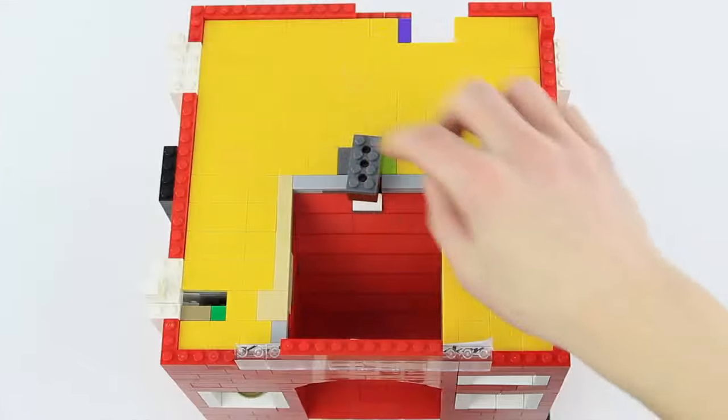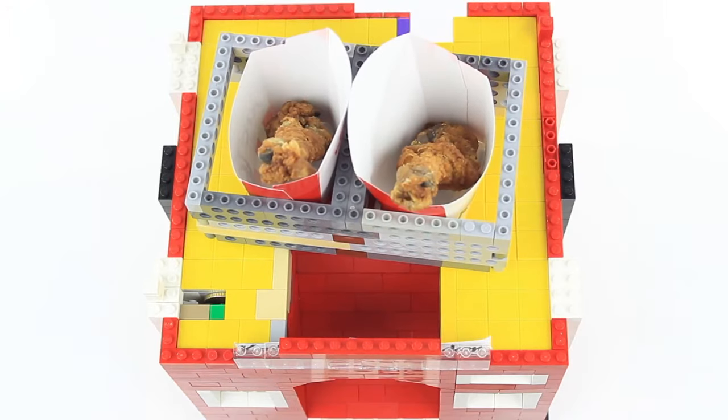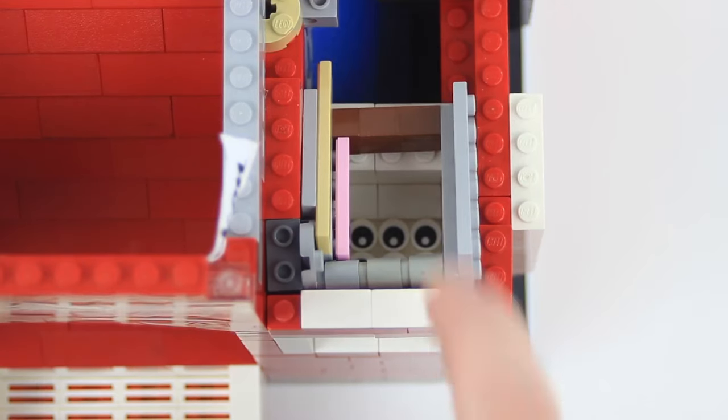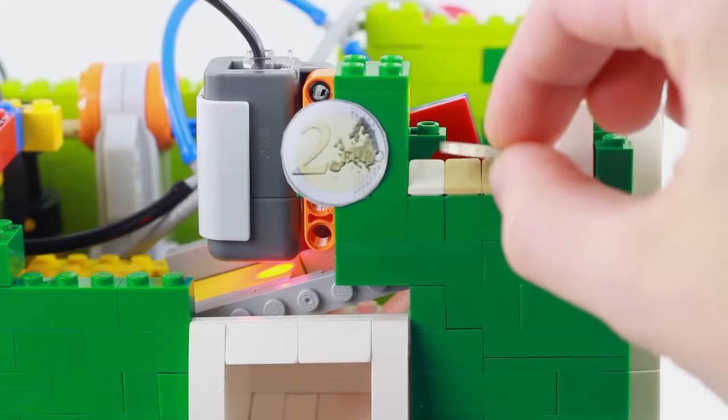What's the best example you can think of for building a coin rejection mechanism? What's the best working way to do that? One that I commonly do — you're welcome to reference my videos — is just a system that rejects them by diameter. So there's a ramp with two rails and a slope that the coins can slide down on a face. The hole should be a diameter big enough for pennies, dimes, and nickels to fall through, but the rails should be just close enough so that a quarter can go through.